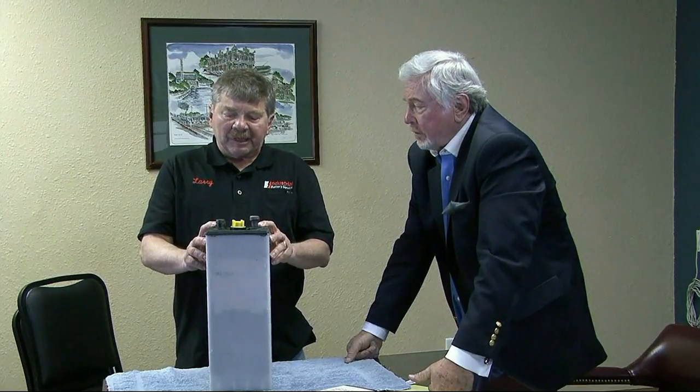As the battery is drained, the forklift will very quickly lose its performance. It's very important that a battery can be kept up to full charge. If it gets down just a little bit below 2.1 volts, the forklift will soon come to a stop and become inoperable. Battery chargers do not recognize when you've got one low cell and the rest of them are higher.